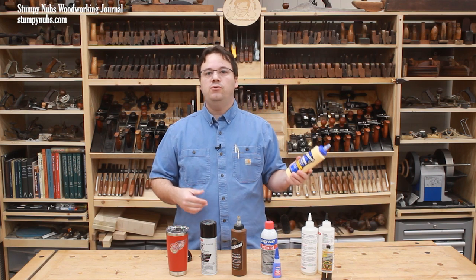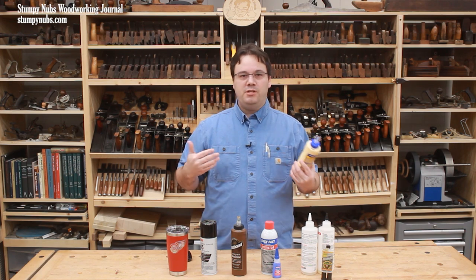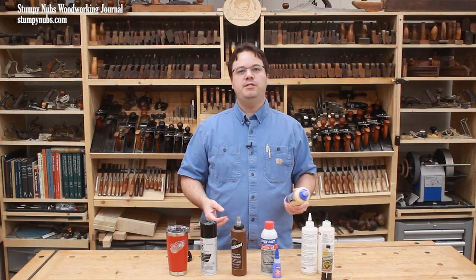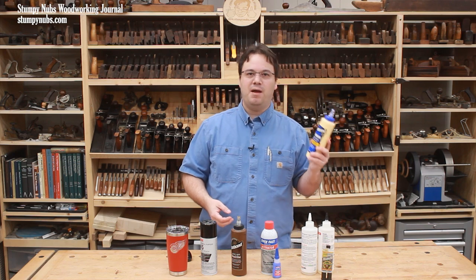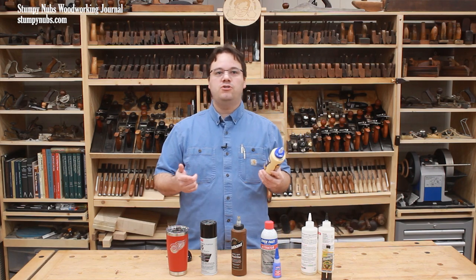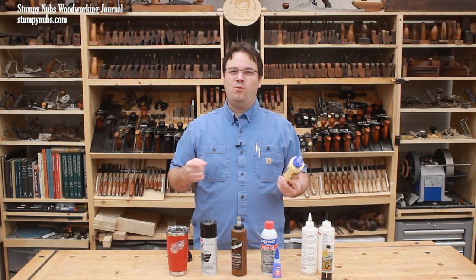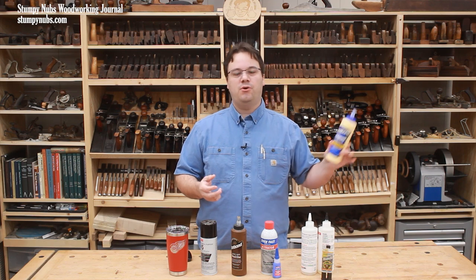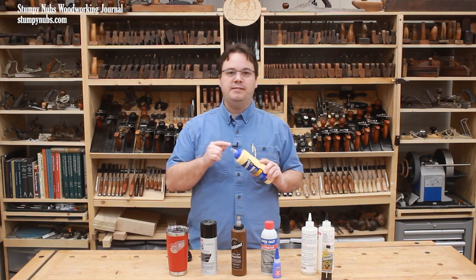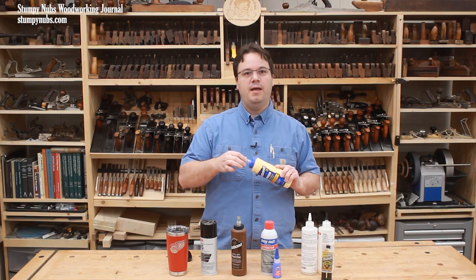Many manufacturers claim their PVA glue can withstand several freeze-thaw cycles, but generally speaking, freezing is a very destructive process at the cellular level of anything, so I simply don't have the confidence that it's not going to affect my wood glue. Personally, I'd keep it from freezing, and if it did freeze, I'd toss it. UV light can also degrade the glue within the bottle — it doesn't hurt to keep it in a cabinet, but I just wouldn't store it on the windowsill. The bottle must also fully seal to maintain the right level of moisture, so keep the tip clean and your cap tight.